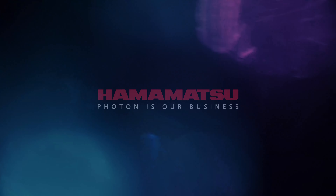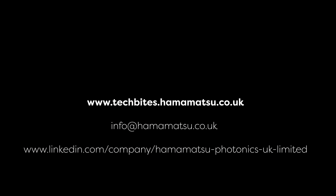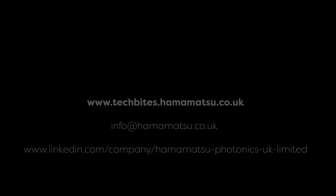Does the camera have any other features we should know about? The camera has its own custom-designed Hamamatsu sensor, which not only realises ultra-low readout noise and 95% quantum efficiency together, but has additional features such as high frame rates, high resolution, and CCD-like uniformity. Frame rate is important when imaging high-speed phenomena. Resolution is key for the ability to distinguish between fine details of a particular specimen, and uniformity means that there is less variation in noise between each pixel. All of these specifications combined are integral to the Fusion BT's performance.